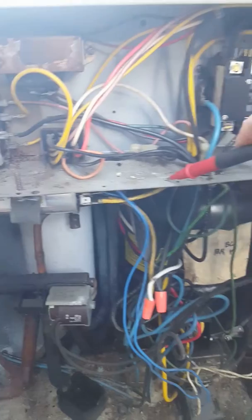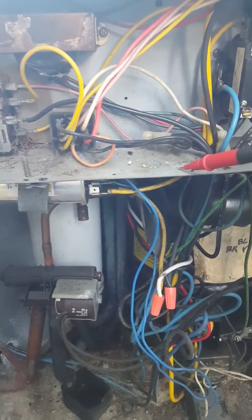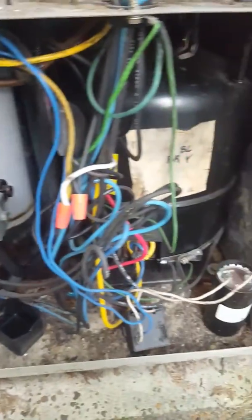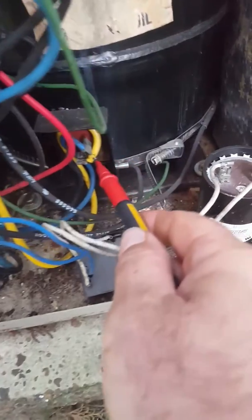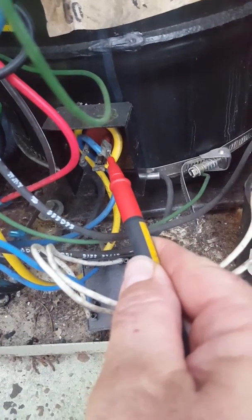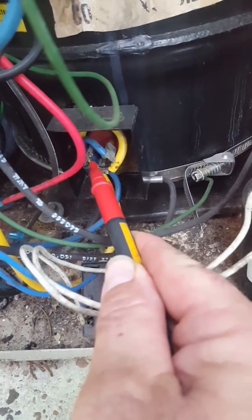See if you touch to the same metal as the other lead — it shorts out. So on the compressor, you put the lead on the compressor terminals here, it ohms out. That's not good — that means it's shorted to ground.